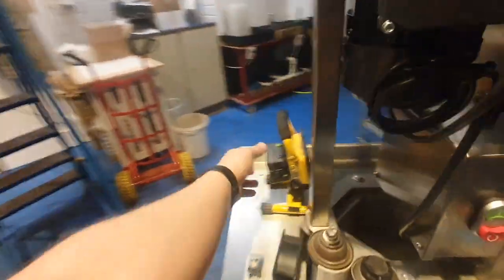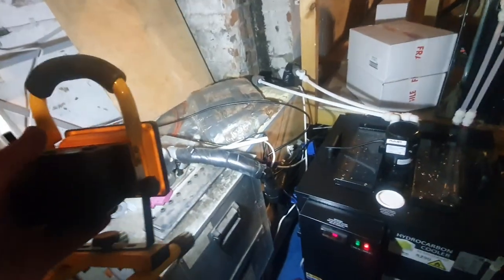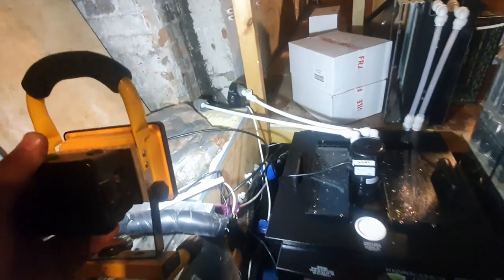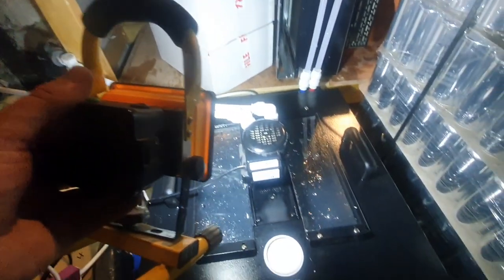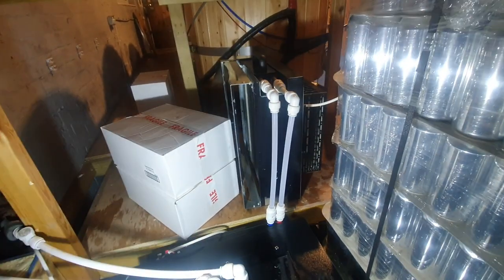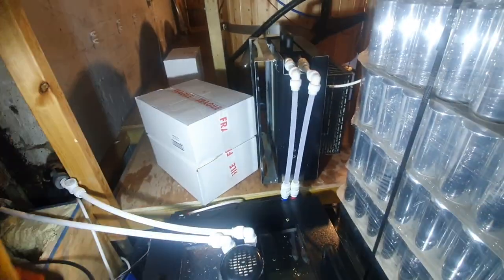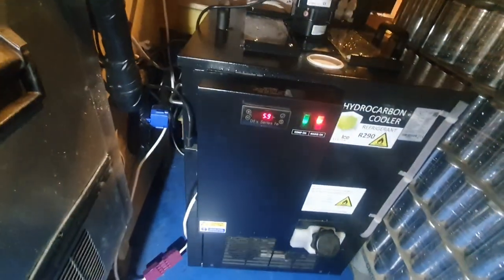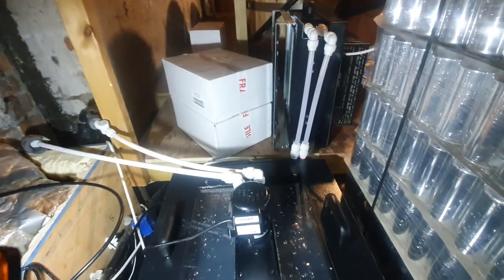I've got a light here, this might help. Here we go — so we're in this little grotty corner of the brewery. When it crapped out, all I had to do was cut the two feed pipes — the glycol supply and glycol return — and hook them across onto the flowjet pump. And then I've just got a heat dump there. I've sat it on the side for today because we're going to have to move all this stuff around tomorrow. But it's doing the job — it's already down at 5.9°C and that's cooling at the fermenter as well.